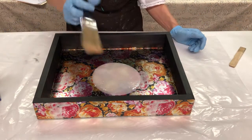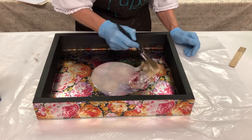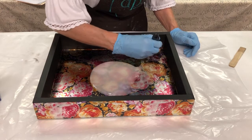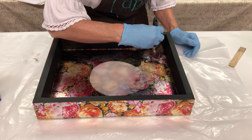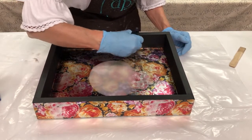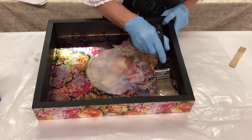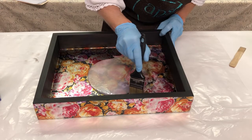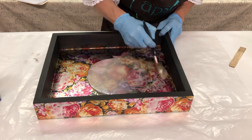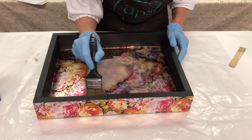I'll put the brush aside and just brush the epoxy all the way up to those edges so it sets up there. The other thing you want to do when working with epoxies is make sure your surface is level. If it's not level, all your epoxy is going to run to whatever side is lower. I normally spread this out with my hand first, but I really want to get my edges and get this down into the sides. Believe me, it's going to self-level and make its way to the edges all on its own, but I just want to make sure it's brushed up to the edges first. Then once I get that done, we're going to hit it with a heat gun to make sure all the bubbles rise out.